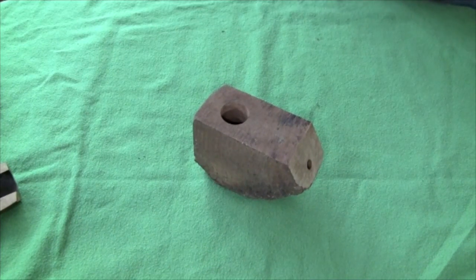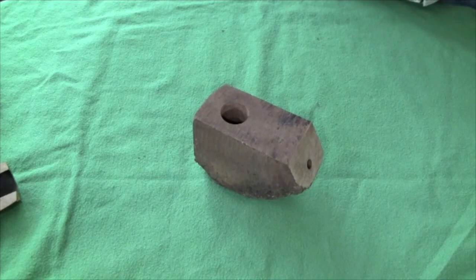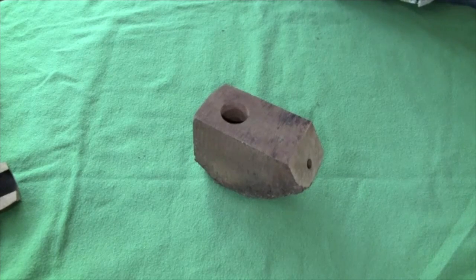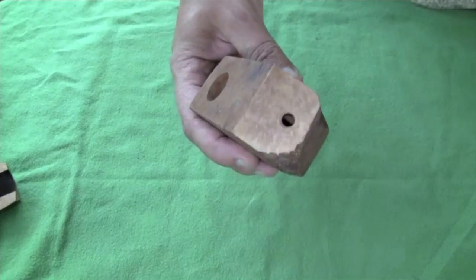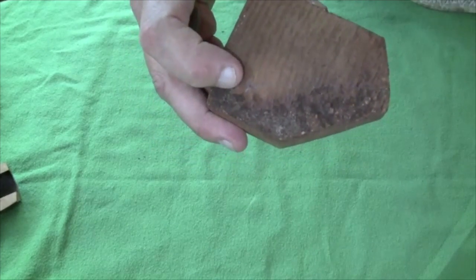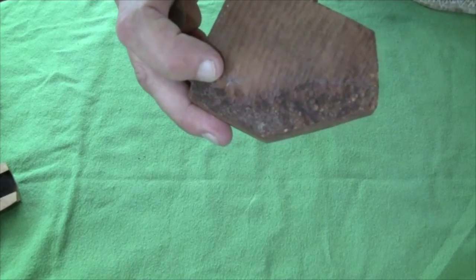The second thing that makes a great pipe, and is equally important as the material that it's made from, is the internal engineering of the pipe. The way the pipe is drilled and the way the drillings are aligned is critical to how well a pipe will smoke. This block has been drilled prior to carving its shape. You can see the tobacco chamber, as well as the mortise, which holds the stem, and the draft hole, which continues through to the bowl. On the side, you can see a mark that the pipe maker uses to align the draft hole with the bottom of the bowl.